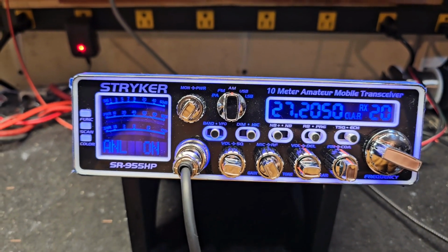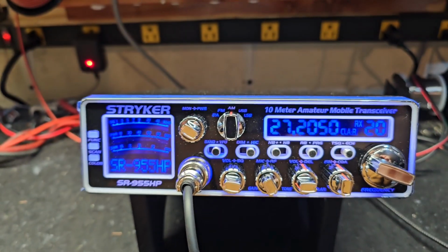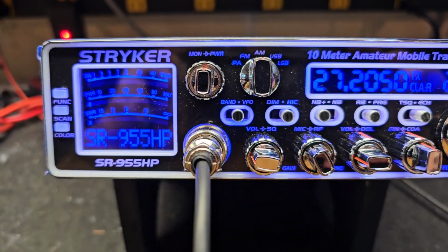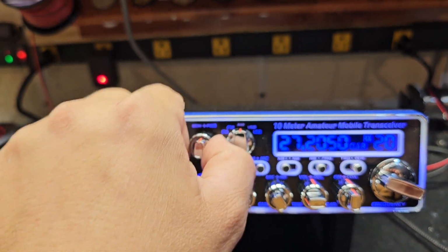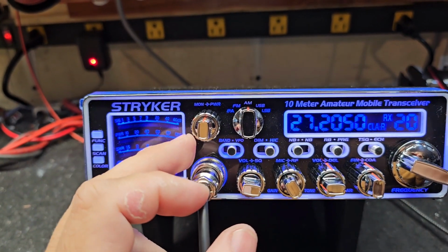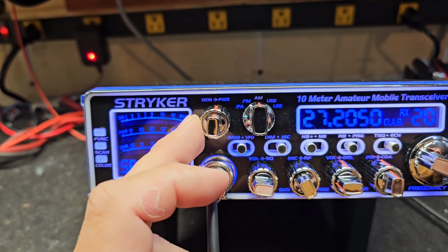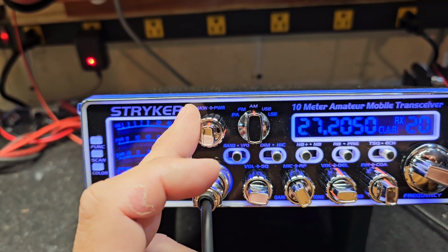Your echo, I'll preset it to what I like, and that'll get you close. Here's your talkback, where you can listen to that. 1 2 1 2 1 2 3. Break. Your RF power, okay. I assume you probably won't be running an amplifier, so you can run this thing. I'd run it anywhere between 1/2 and 3/4 all the time.